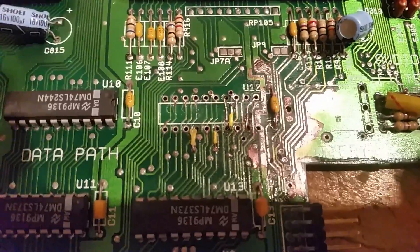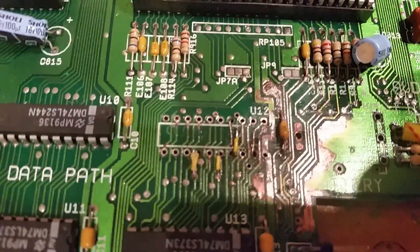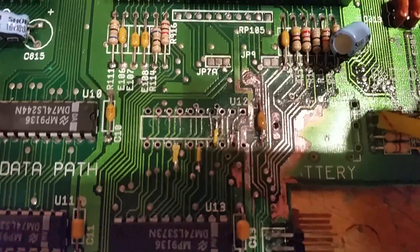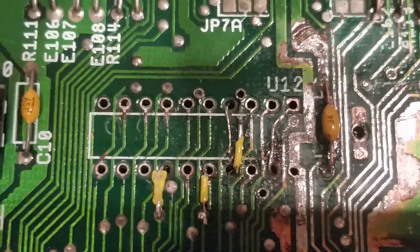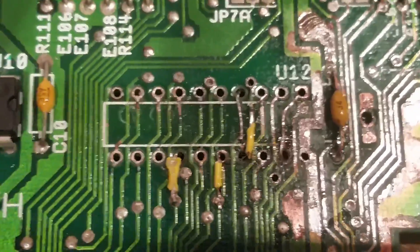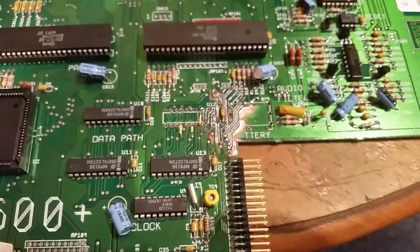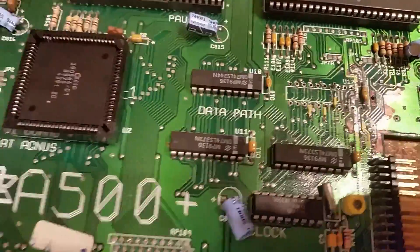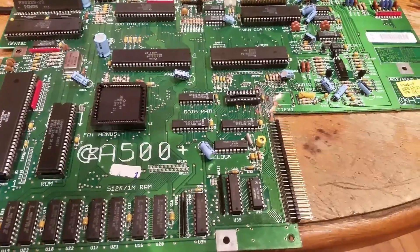Well that was a royal pain in the arse. But now you can see I've basically made it with wires — I wasn't going to use insulation but I thought better of it. I've essentially replaced where the eyelets came out with bits of wire going through the holes. And if the camera ever focuses you'll see how that works. All that remains is to check there's no bridging — don't think there is. That's the repair job done and the socket will go on top. It won't sit quite straight because of the wires, but better than not working at all. Sockets are back on.